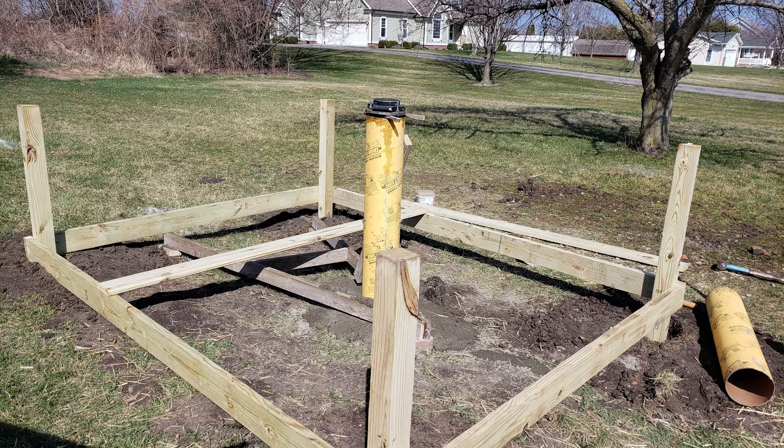Observatory phase one is complete. Thank you so much to my brother Michael and my brother Ian — they came over and were rock stars, they really helped me get the labor done. Getting those holes dug was not a one-man job. We used a 12-inch bit to go down 4 feet for the main pier, and we're in some nice hard clay, so I wasn't worried about putting a big footer on the bottom. We just poured a wide slug of concrete in there, and that'll be plenty to hold it. Huge thanks to my brothers, they were awesome.